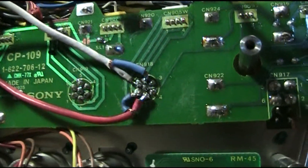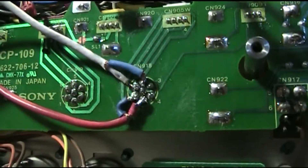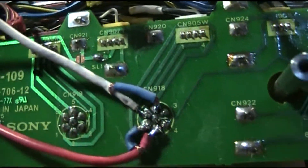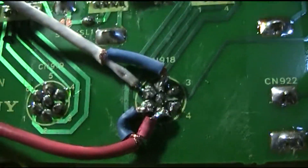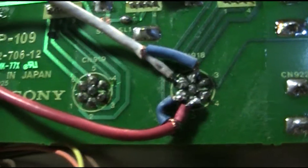When I took this apart, I was horrified by my own lousy soldering job, so I decided to pull off all the hot glue and redo it. This time I think I've done much better from the start. I need to make sure that especially this upper join here is good. The white cable is luminance, the red cable is chroma — and that's not S-Video, that is Umatic dub.